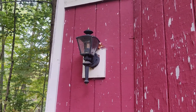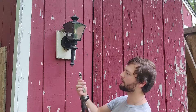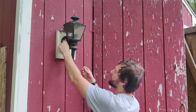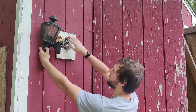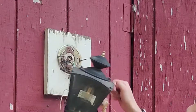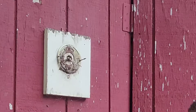Next is taking this off and disassembling it. For my light fixture I had to use a pliable wrench to get these off and then an actual socket which was about five millimeters, but I loosened that up so now I can take these two nuts off. For some reason they're different than the original. Now that we have that off, you should be able to see — normally not this gunk and leaves — but you'll see the hot, neutral, and ground wires which you can just disconnect.